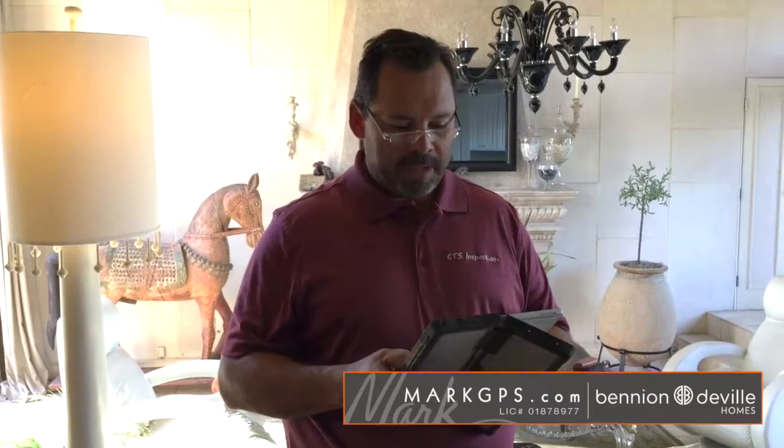Yeah. Also, there's a little section of electrical conduit above the master bedroom that's laying on top of the roof surface. It should have 2x4s lifting it up off of that foam, so that way it's not foamed over and attached to the foam roof, which it is now. So it should be lifted up, propped with 2x4 blocks with a little bracket that secures it to the blocks.